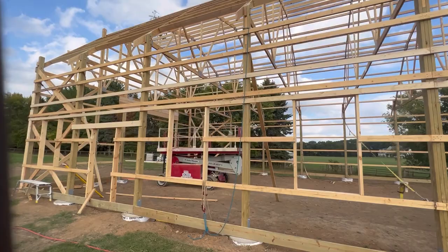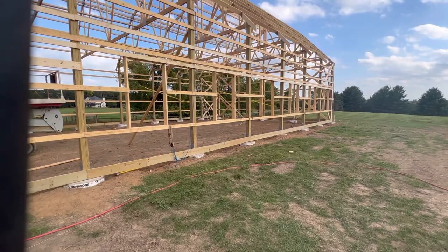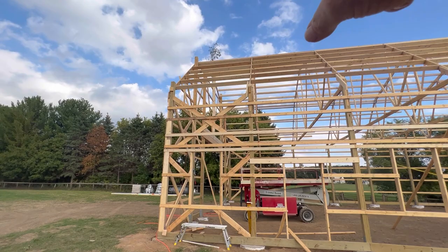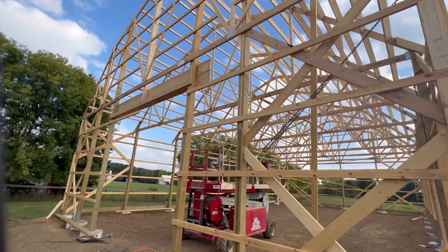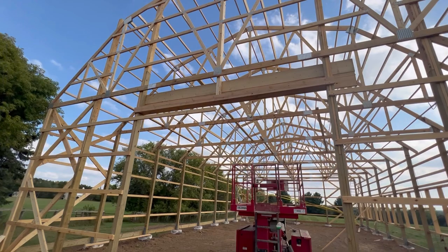Here's our three-foot man door — I've got a little bit more work to get that secured. It's starting to take shape. We also got the last of the purlins in. We built our header for the door: we've got a two-by-six between the posts, a two-by-six on the outside, and then a double two-by-twelve on top — that's just to attach door hardware and door openers and get some stability.